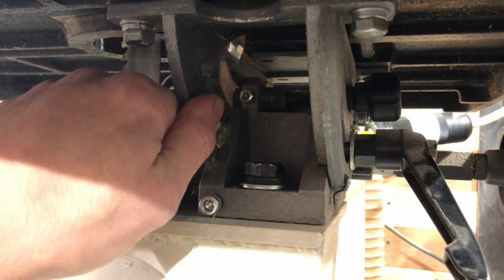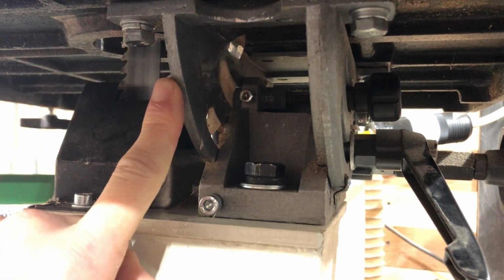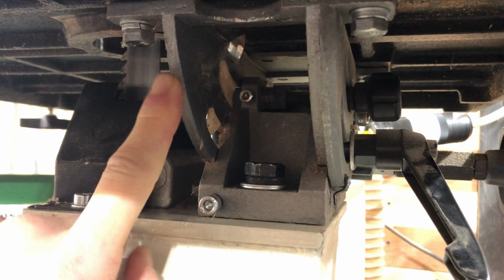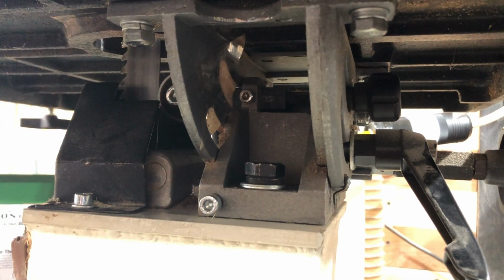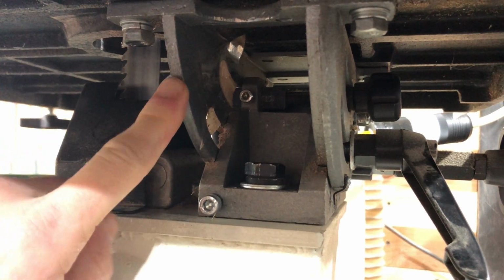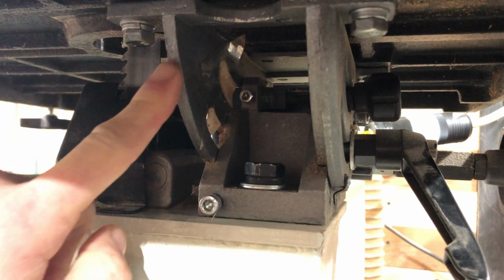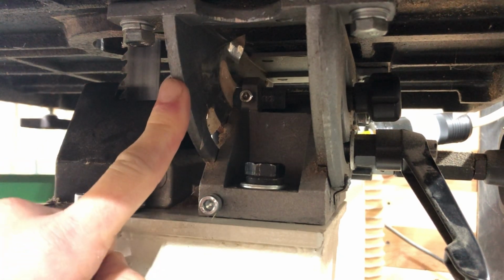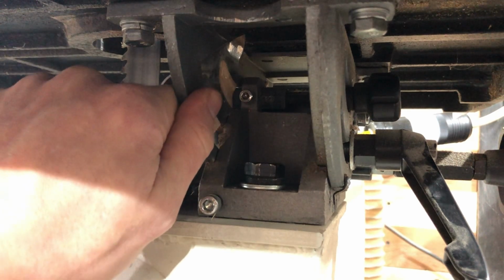The lower trunnion of the saw is one of the things that people overlook a lot when buying a bandsaw. This is super important because this is what stabilizes the entire table. If the company skimps on these, your table is going to flex and move when you put anything substantial on that table. These are about 6 millimeters thick, and I'm sorry I'm switching back and forth between metric and American, but these are of course all made in China, and so most of the dimensions on these saws are going to be written in, the conversion is going to be metric. So these are 6 millimeters thick.